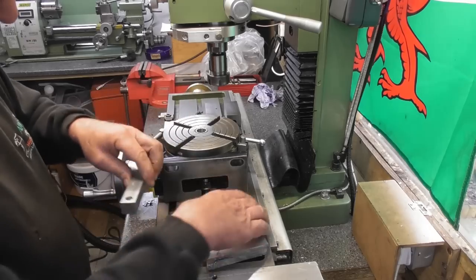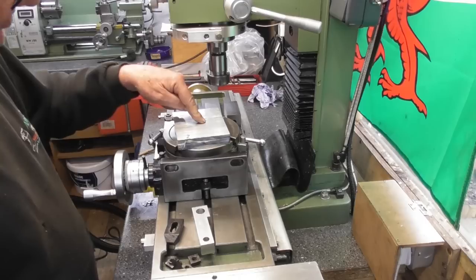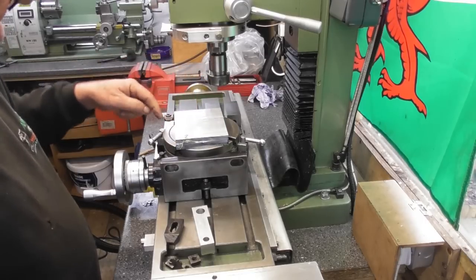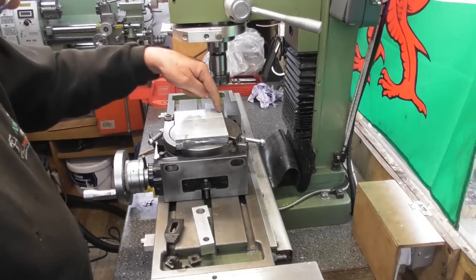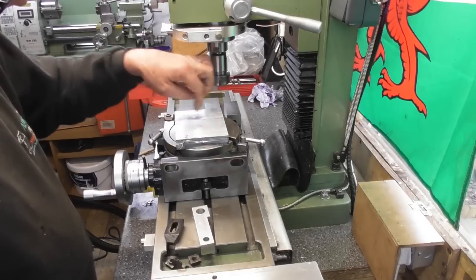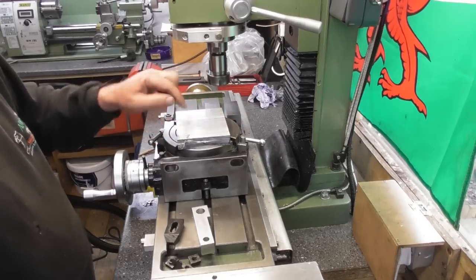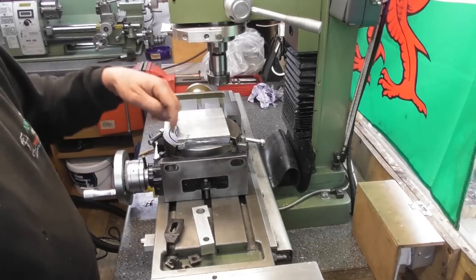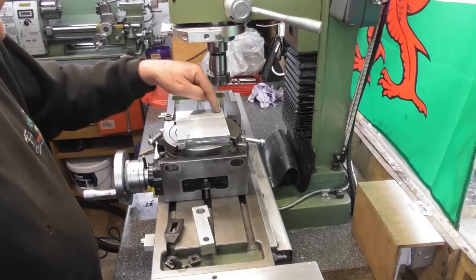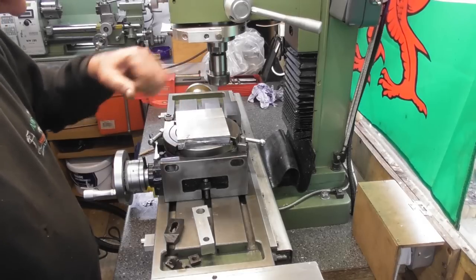Right, okay, so that said, I found this piece of aluminium, which will have to do. Without using a huge piece, it's the only appropriately sized piece. As you can see, with the four slots, something will work out. I'll probably put some countersunk M8 screws in four corners, and then the central bit will do whatever I like. So I think I'm going to take the rotary table off, just square this block up, put some chamfers on it maybe, and then look at positions for four M8 clearance holes, countersunk for M8 Allen bolts, and we'll get that sorted first.